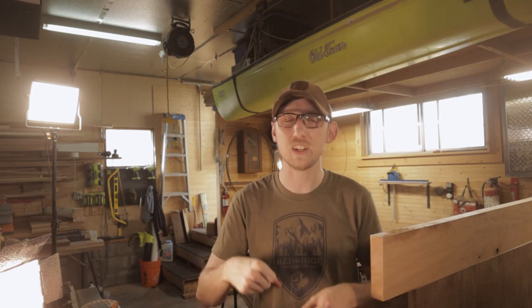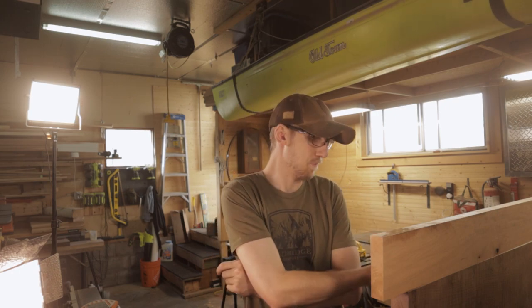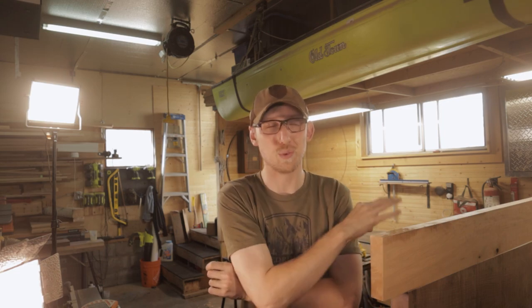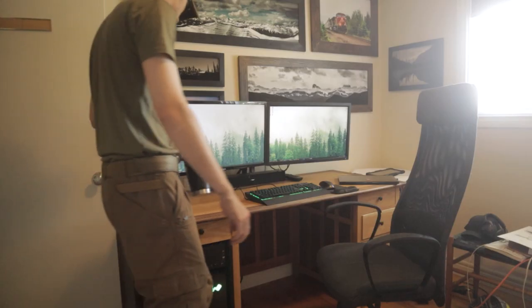They are kind of a useful tool to have around, if you're trimming door frames and that, when you can't accurately move a hand plane in that direction. So it might be a good tool to have around. But also the option of buying just a sheet of MDF and turning it into a router sled, I really like that idea, because then I could work with big boards like this. I can't actually go any wider than 12. This would be the biggest board I could work with, but I could work with boards like this. I think there's something to that. I don't know why my brain is so obsessed with keeping this board solid right now, but if I have the option to do it, I really, really want to try it.